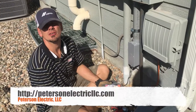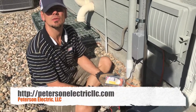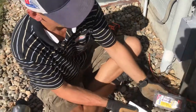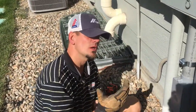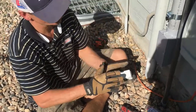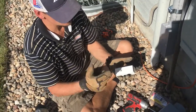Hey guys, Joshua Peterson here with Peterson Electric. Going to talk to you today about Inter-System Bonding Bridge Bar. Article 250.94A talks about how to ground in a home. Exception 1 talks about if you had a disconnect, for instance on a pole for your utilities — this states it has to be near the first part of the disconnect or the service of the property in a residential situation.